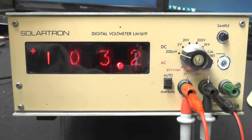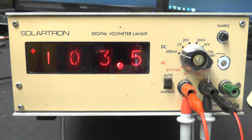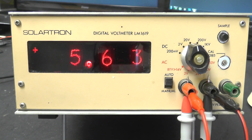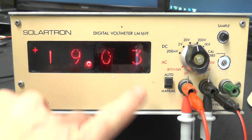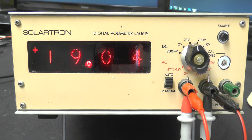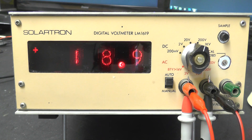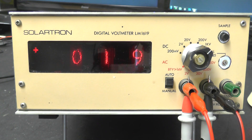And we're on. At the moment my power supply is saying 103 millivolts, which is pretty good on here. One and a half volts. Five volts. I wonder whether this is just slightly out a little bit — my multimeter is saying 19.000 whereas this is 19.045, so maybe it's just slightly out on the higher range. So that's 19 volts on the 200 volt range giving 18.9, and on the kilovolt range we've got 19.